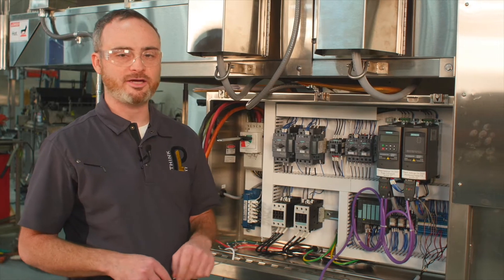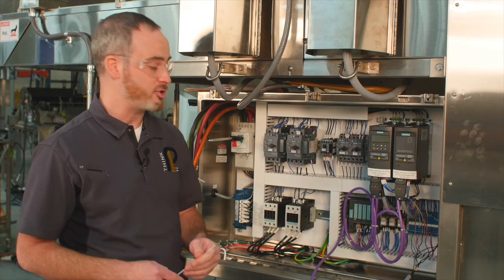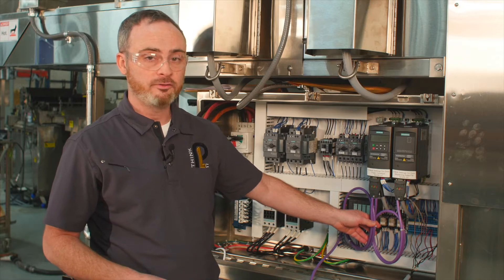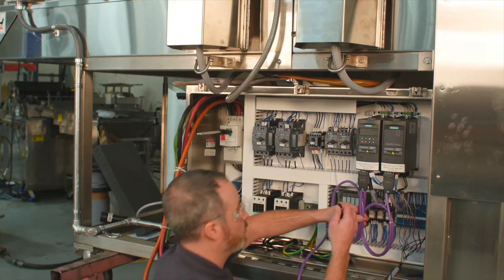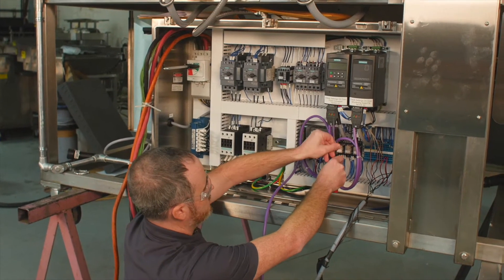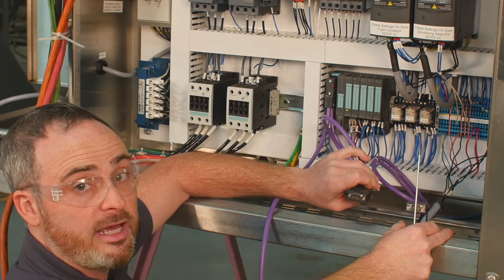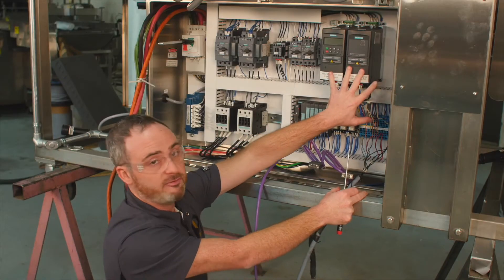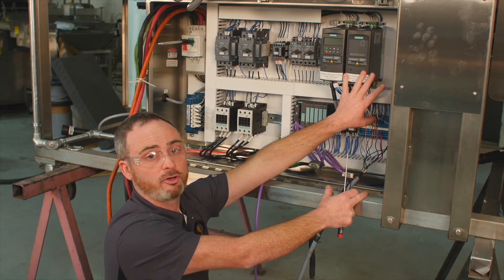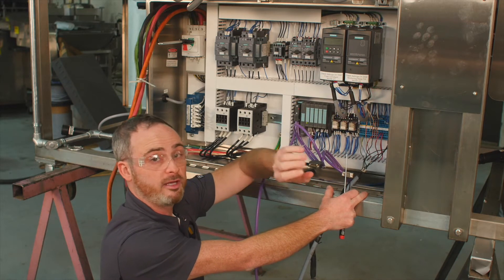Next part of the replacement is to demo the equipment that's in the machine. We'll start with the communication cable — the purple PROFIBUS cable. We'll carefully remove the screws underneath the connector with a flat screwdriver, unscrew counterclockwise, and carefully lay it down as we'll repurpose that cable later. If your system has three VFDs, don't be alarmed — that's an old filtration pump system no longer used. If you do have the third VFD for filtration, remove it and don't replace it.